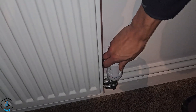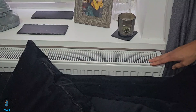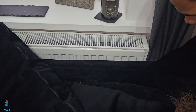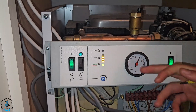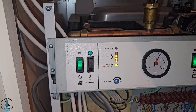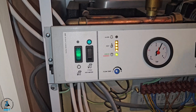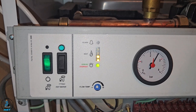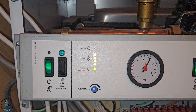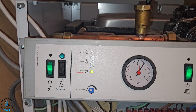That one's on two, so I'll open that up fully. This one's got no TRVs but I can feel the heat starting to warm up. We've got two radiators off and it's already modulating down. I'm also going to turn this down to the middle so the demand's not as high. As you can see it's modulated down to one — it went up to four but it should come right down, and you can see it's dropped down now, as it should.